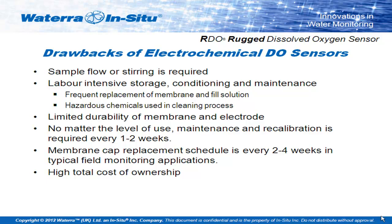So there's quite a high maintenance cost behind them, making long-term deployment difficult. The membranes on the front are also quite delicate — serious abrasion, any sediment in the water flows, will gunk up, block, and degrade the membrane. So while a useful way of taking spot dissolved oxygen measurement samples, long-term monitoring and deployment with these sensors becomes difficult. They become expensive to maintain and increase your staff costings.